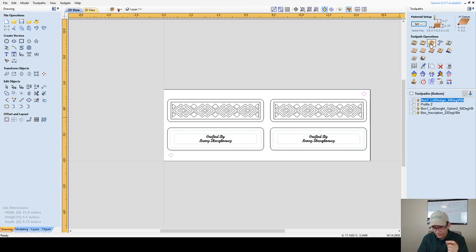as it pierces the surface, and then it's going to straighten back out and cut. What's going to happen is that little flex as that bit pierces the center of the hole, as it starts to straighten back out, now it's creating a little bit of an oblong. So your diameter is just a little bit bigger. Might get a little wobble. I'm going to be changing back to the 22 degree V-bit. If your holes are not coming out quite right, if they're a little loose fitting, try using a pocket cut toolpath with an undersized tool. So if I'm doing a quarter inch diameter hole, I do a pocket toolpath with an eighth inch bit. Now, if your CNC is rigid and you don't have any problems with flex and your quarter inch holes are quarter inch holes, then you're good to go. So keep that in mind.